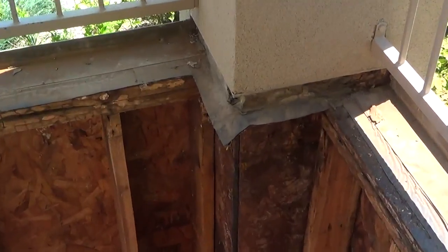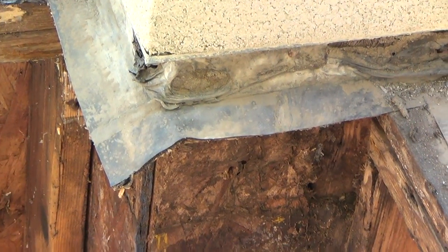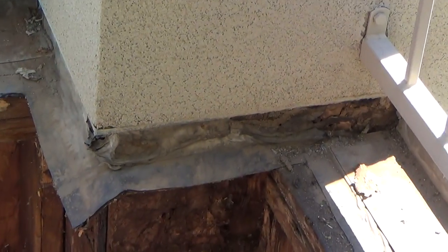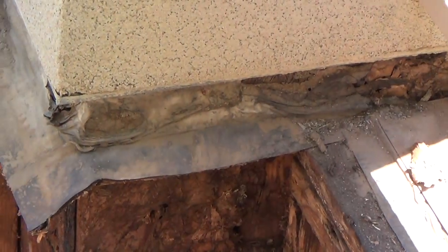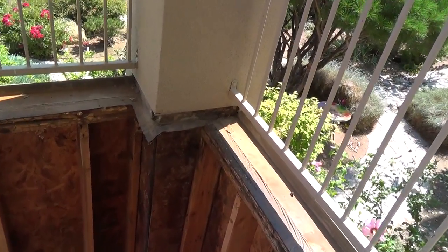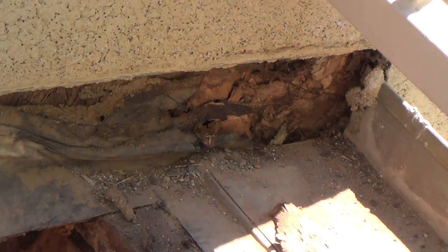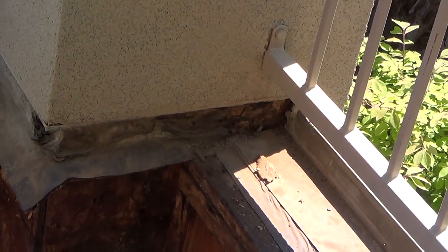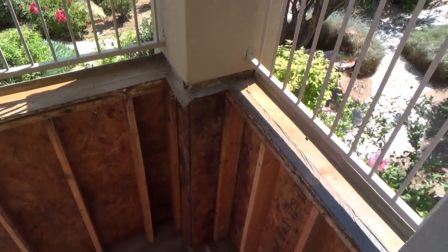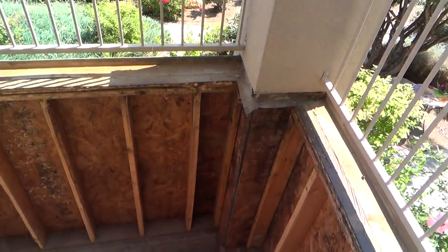Of course, right in there where that black roof, that black flooring material is, I'm gonna have to cut that off, and I'll probably have to cut it up to the bottom of the stucco. And see, that bottom of the stucco has a little metal trim piece right there. And so that black tar material goes up to there. I'm gonna have to clean that out of there and see where, remember, it failed. I was showing you the other day, it failed all the way over to the edge. See that? I'm gonna have to take all that stuff out. And in order to do that properly, I may decide ultimately to take this piece of flashing off. Well, it's one step at a time, little by little. I'll formulate a plan, I'll make some sort of decisions on what to do.